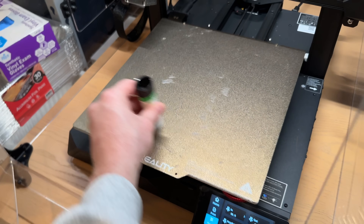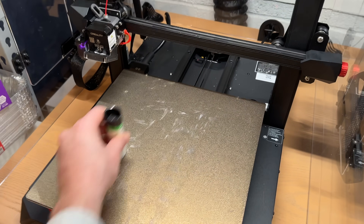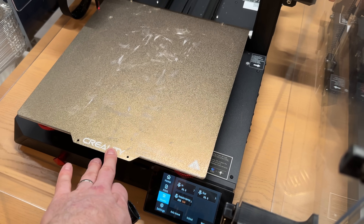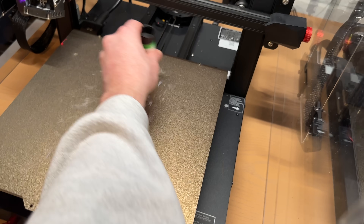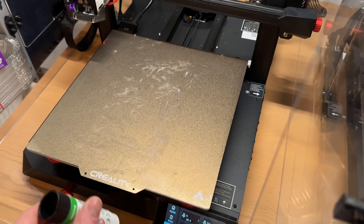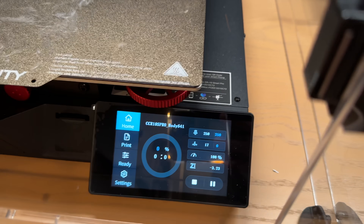The reason you put glue stick down sounds stupid, but it helps the model stick to the build plate — it's common practice. It gets a little messy and makes the build plate harder to clean, but it helps especially in colder temperatures. The build plate is heated, which also helps the model stick, but the glue stick adds a bit more. The problem is when it gets hot the glue dries out quickly, so it really only helps the base layer. The shoe is positioned facing a certain way so I only need to apply it to the middle of the build plate.